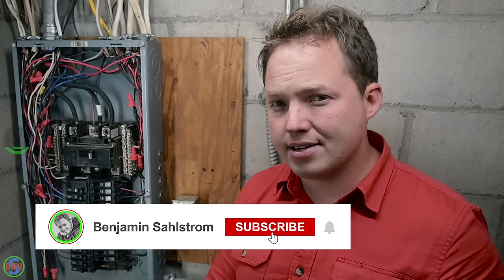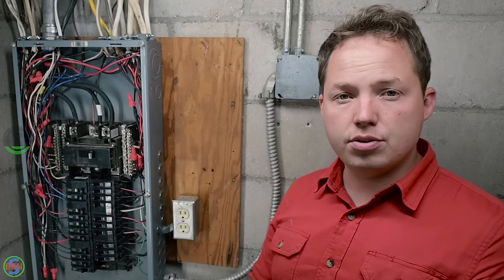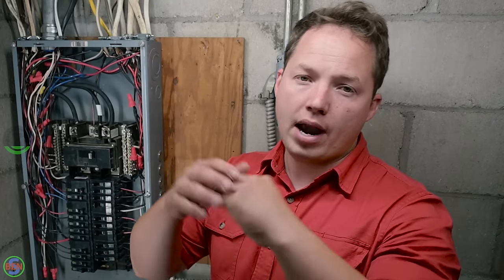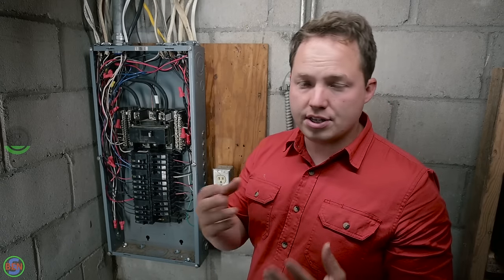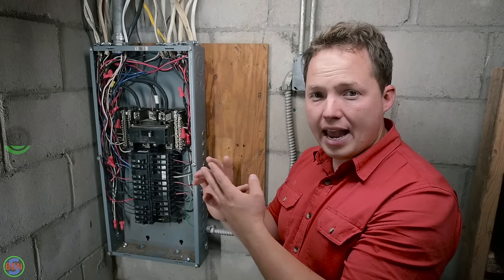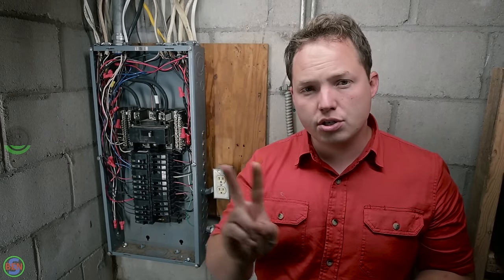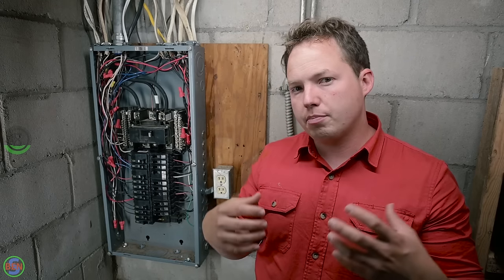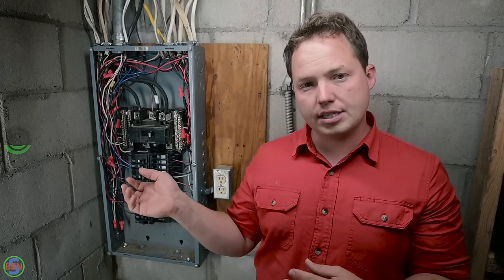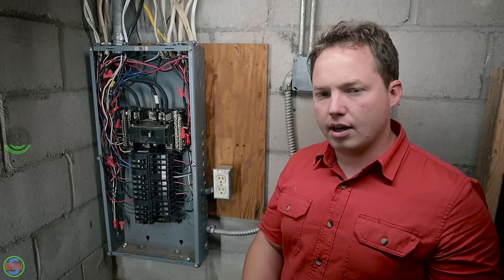Prior to the 2008 National Electrical Code, if you were running power to an outbuilding, you were not required to run that fourth conductor. And so prior to the 2008 National Electrical Code, if you're wiring a separate structure and feeding a sub-panel in that structure, the requirements were pretty much the same as if you were basically setting a main panel, because everything was bonded together with the neutrals and the grounds in that sub-panel. And then you also had the requirement of your two grounding electrodes outside, unless you could prove less than 25 ohms resistance to earth, and then you could get by with one ground rod, and everything was just tied together the same as a standard main panel.